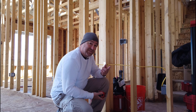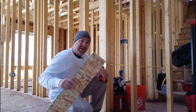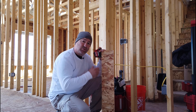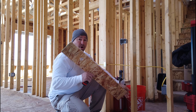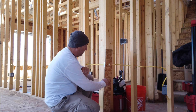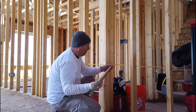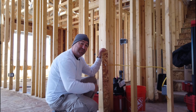Alright, so I want to make all my holes across the whole place. First thing we're going to do — when I mark it, I'm going to go ahead and get a template. I get one that's obviously longer than 28 inches and I drill a hole on the top dead center and at the bottom, or if you flip it, at the top dead center. Then when you want to make a perfect hole, you just put that down as your template. I don't care if you're using the top or if you drop it, you can flip it. Both of them are going to be exactly at 28 inch on center and you're going to have a perfect run.